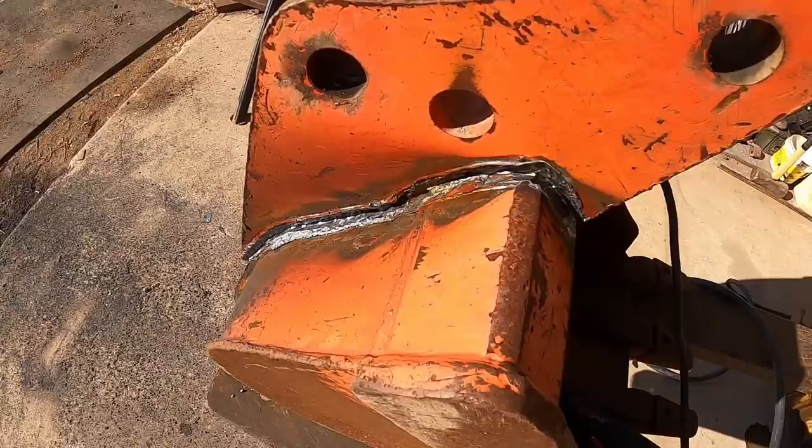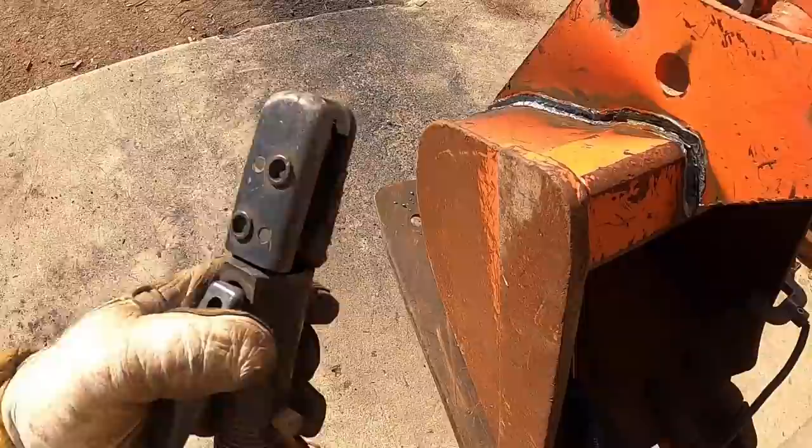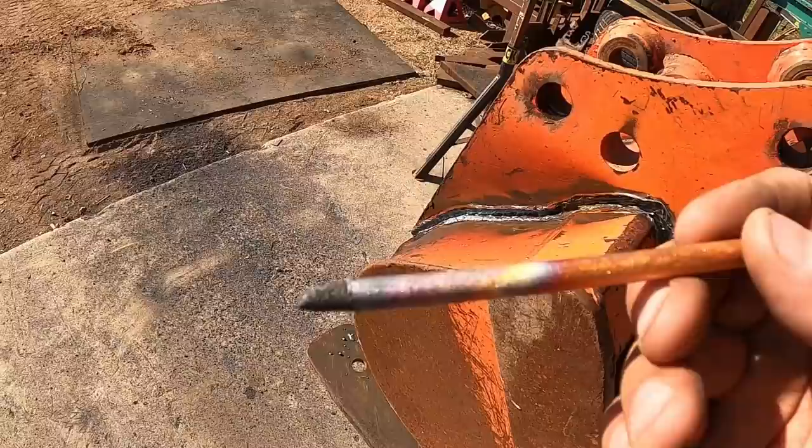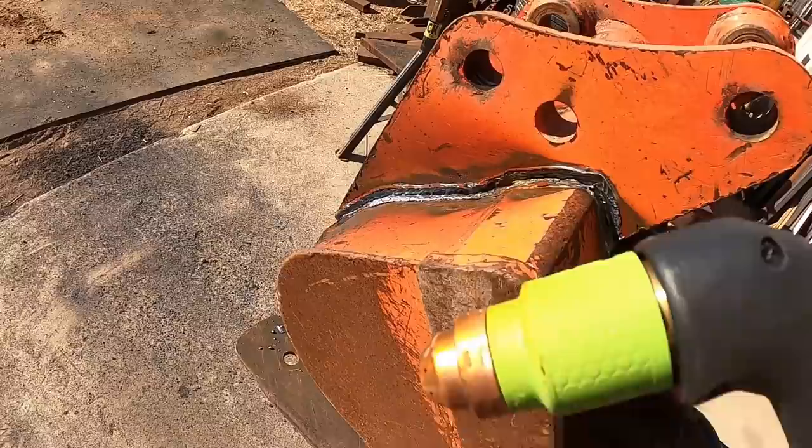Let me show you. With this one here, you have to have an additional cost of this holder and the carbon electrodes. And this one does take a little bit more skill, similar to welding and the same type of weave pattern or straight line, depending on how you weld. Whereas this one, pull the trigger and go. Go until you see the separation line.